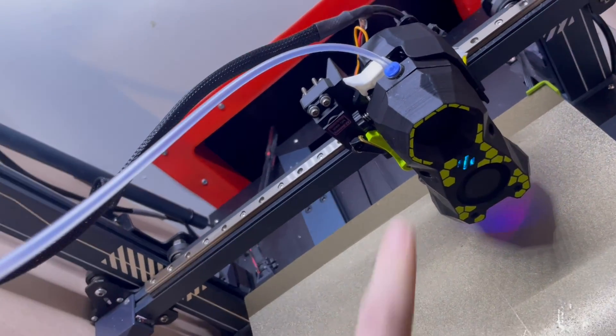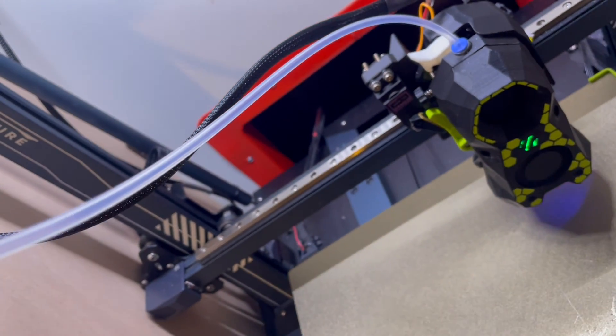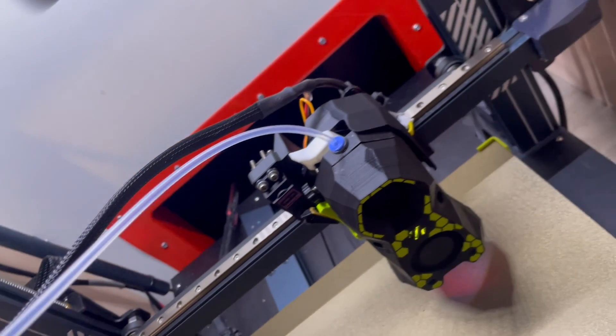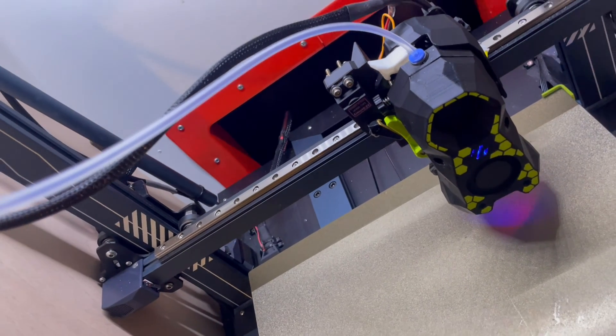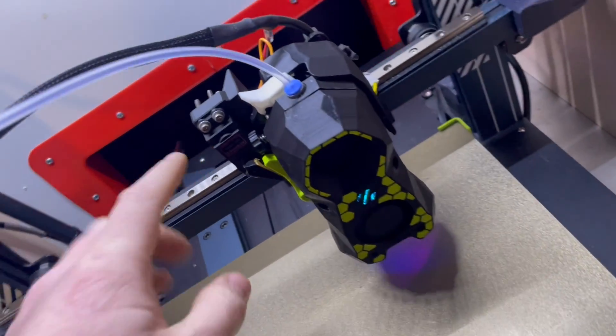But that relies on essentially taking the tool head at speed and crashing it, so obviously you lose steps. Every single time I'd cut the filament, I'd have to go and home the X-axis, otherwise skip steps. That's why I went with the servo - I've seen absolutely no detrimental effects.